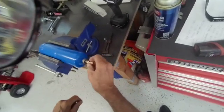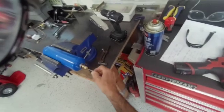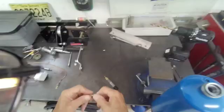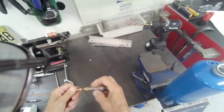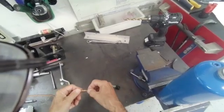Now take our fitting — so that's in there. What we'll do is pull out the schrader valve and then solder this in and we'll be done. Let's remove the schrader valve out of this fitting, then we can solder it into place.